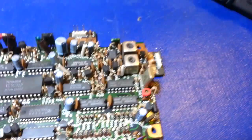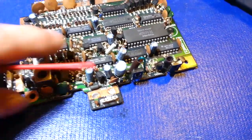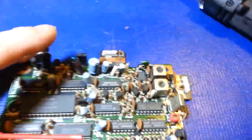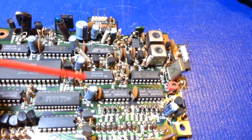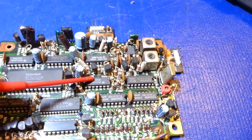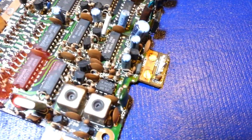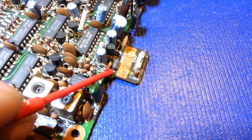If you see any Sony bond, some of these things you'll see it gooped down in there with parts all corroded. These modules get rather hot - there are a lot of ICs packed into that small package generating a lot of heat, which accelerates the deterioration of that glue because it becomes conductive and corrosive. Usually in these frequency counter modules the Sony bond is already completely baked - it won't be gooey and tan anymore, it will be dark brown, conductive, and highly corrosive. You can see that one inductor is bubbly - that's corrosion from Sony bond right there.